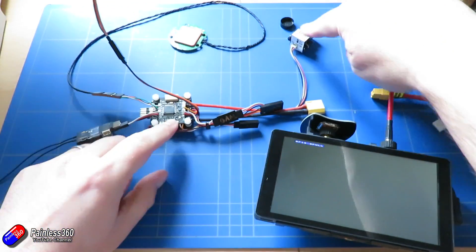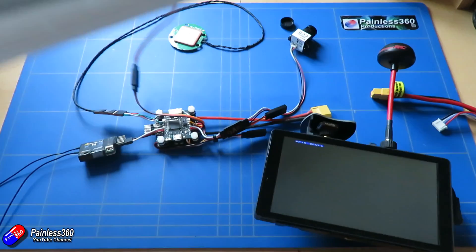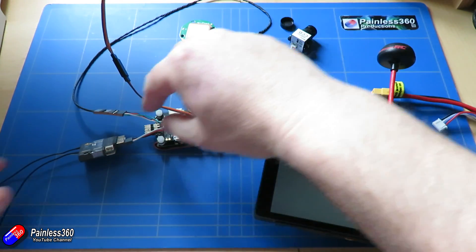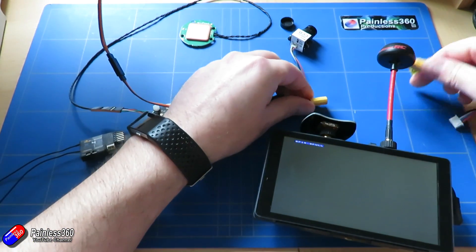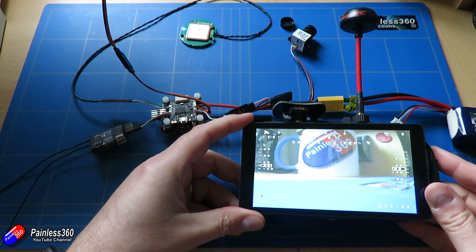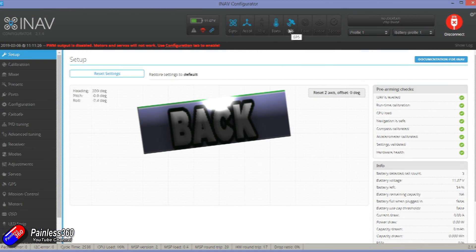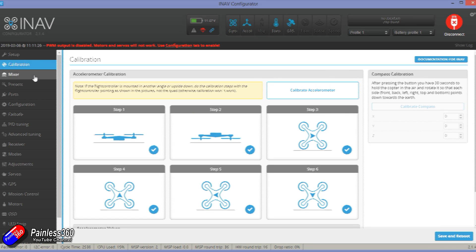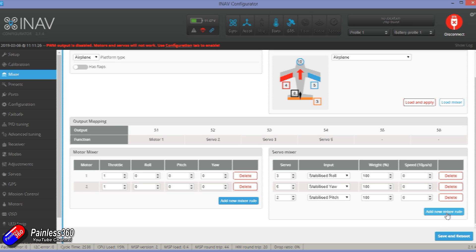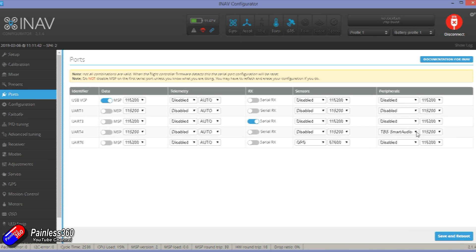Out of shot the VTX is already sunk into the wing of the Bixler with all its wiring set. All I'm going to need is to solder the ESC, then power it up and make sure there's no magic smoke. The great news is it absolutely works — and it's actually seeing the GPS. Going back into iNav you can see the GPS is live and working. Calibration was done last time, mixer doesn't need touching for the moment. Here are the ports: I've selected TBS smart audio although I didn't need to — I can disable that. UART 6 is the GPS at 57600 baud.